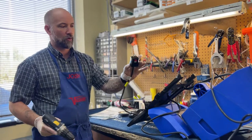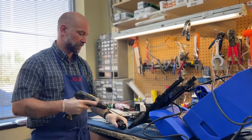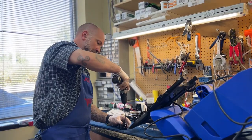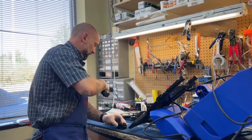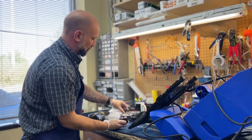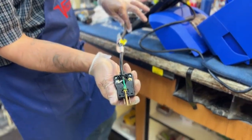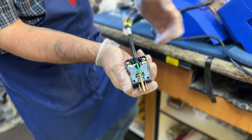On this machine the cord end is a GFI, and the GFI actually comes apart — it's four screws. You can pop that open and the wire simply screws in inside that GFI, and you're able to remove the wire by removing those screws.